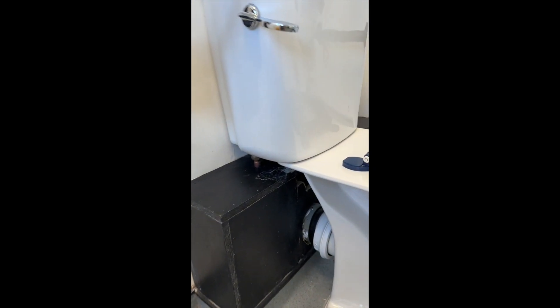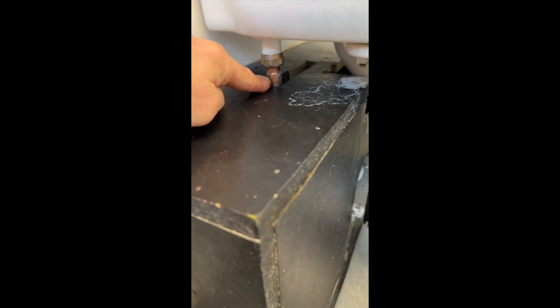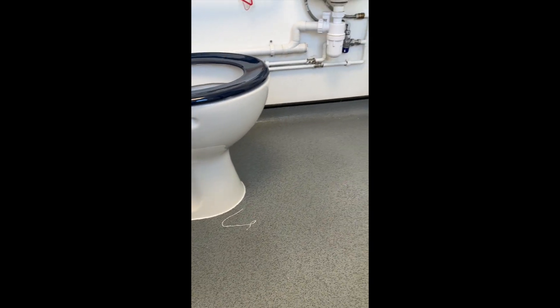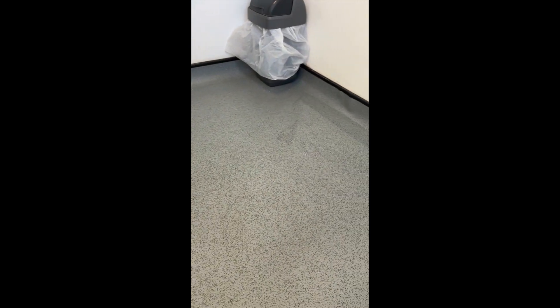Looking into the toilet, there are some old signs of water but it looks pretty dry. If I put my hand around there, it's really wet — my hand has got a load of water on it. It's not pooling on the floor by the toilet, so I think it's probably running down the back of that boxing, getting underneath the floor. As it's a nice wet-room floor designed to stop any water escaping, it's also stopping water coming through, and I'm guessing it's making its way under the floor and coming out at the lowest point.